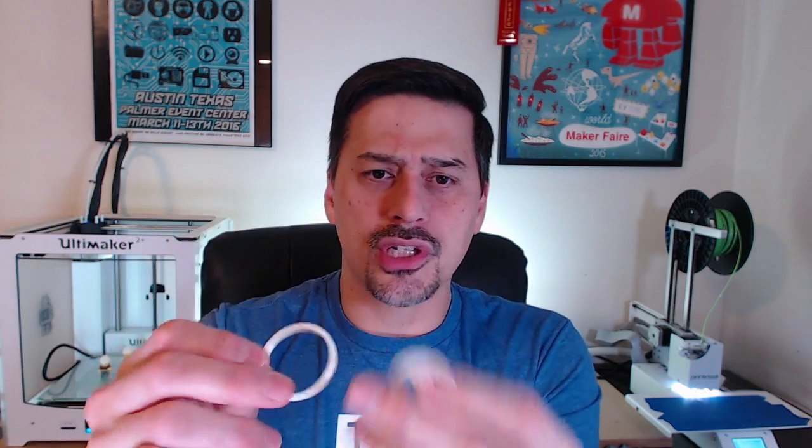These don't always end up perfect. One common thing that happens is it'll just fall apart. That means you need to adjust or tweak a setting — if you can bump up your extrusion factor a little bit, that helps. Going into Tinkercad, you can of course adjust the model to fit your printer.